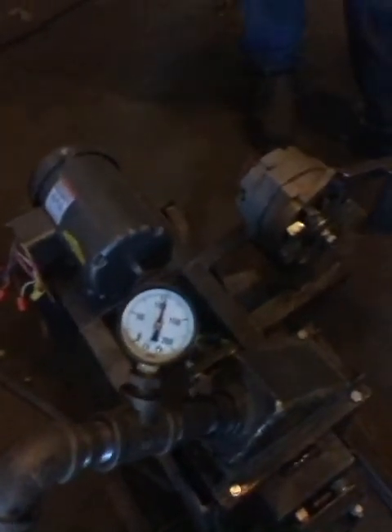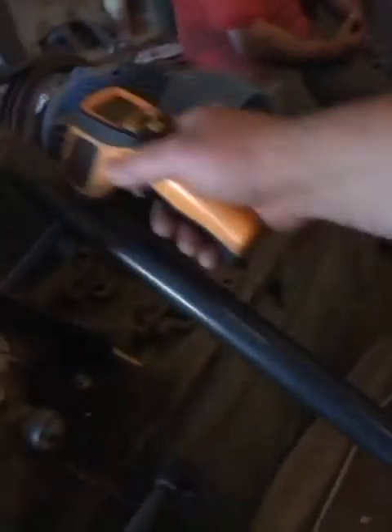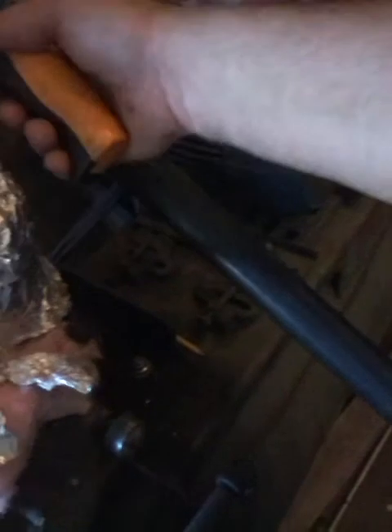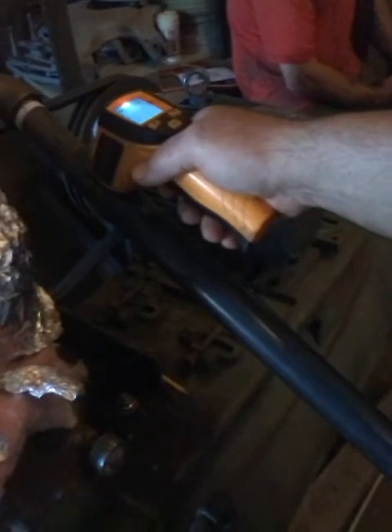It's been another couple of minutes and we are now just starting to creep around. We've got enough torque in the Tesla to begin to turn the three-phase motor, which is a self-exciting generator with capacitors in a Y-star pattern. So we're starting to develop a voltage. We're still at about 100 to 105 PSI. The one thing that's different now is the temperature — we've got 195 to 201 degrees.